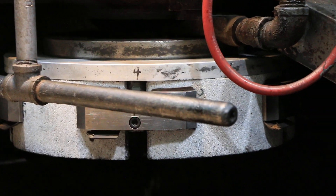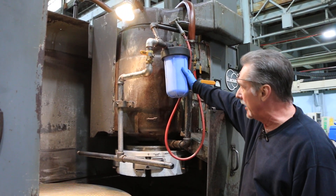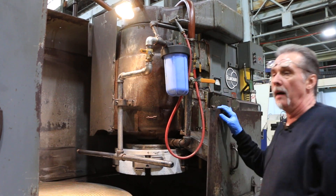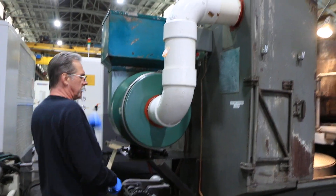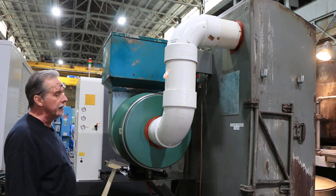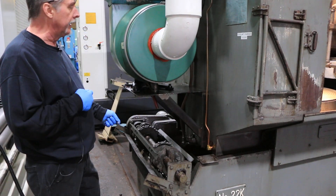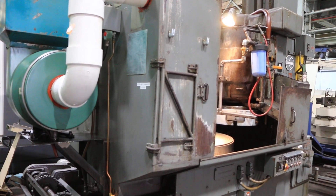The previous owner has also added a mist removal system to it. There's a coolant filter that was added by the previous owner and a spray bar so you can spray coolant across the entire chuck. Normally they just dump straight down — this is easily removed if it's not something you like, but I think it's a really good idea. On the end of the machine they've also added a mist removal system — AER brand control systems. These things do develop a lot of mist when you're really hogging parts and they get hot, so it's probably a pretty good idea. When you turn the coolant system on for the machine, that triggers the automatic rake, so the operator doesn't have to clean it. It turns on the coolant and also activates the mist removal — all with one button. It's all automatic.